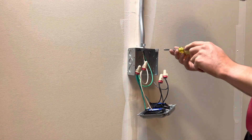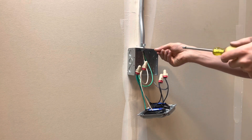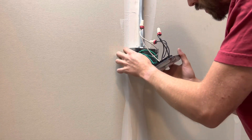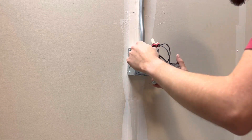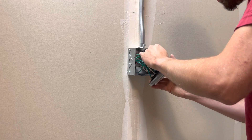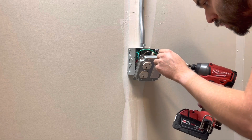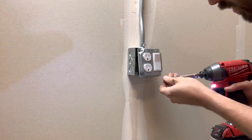Those are all good to go. Now we are ready to remove the box screws to put on the cover — I'll switch over to my drill here because it's going to be faster. Once we are ready to put in our wires, we're just going to simply fold these up nice and tidy. It's nice when you have solid wires because they actually stay in place where you bend them, unlike stranded wires. You're going to fold these up accordingly, give them a nice bend, slowly get that ready to go, and then mount our screws in their locations.